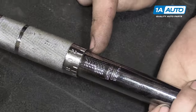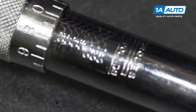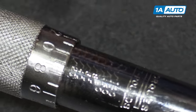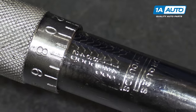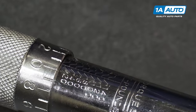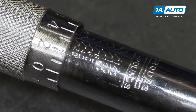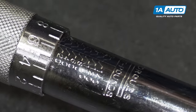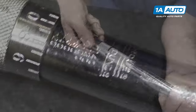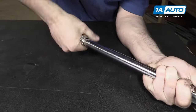So to find 140, ours goes in increments of 10 to the straight center line. When the top edge is flush with the line that has the torque we want — see our 10 kicks down here, goes flat — we have zero designated with the line, so we're at 10 foot pounds. Each tick mark on this particular model is one foot pound, so we count up 11 through 19, and when we hit zero again, we're lined up with the notch on our 20. Since we're going to 140, we're going all but the last peg, so we'll turn this all the way up.